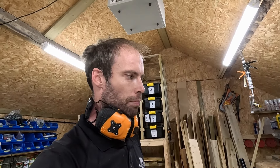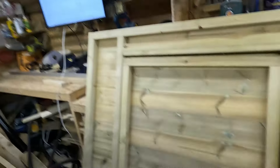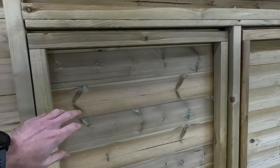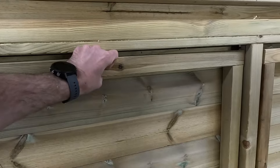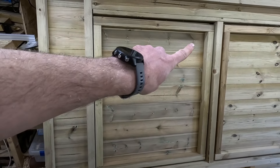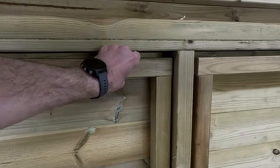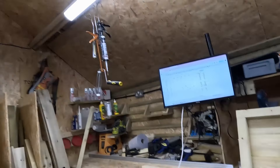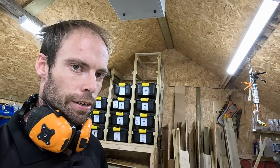Well, it doesn't always go as planned. This is the current issue. So this is the back of the front piece - these are the doors here, you can see the gap around. I have forgotten to put the diagonal in. Normally I have a diagonal piece that goes from that corner up to that corner there, and it just stops this end from sinking over time and sagging. I completely forgot to put it in, so I'm going to have to try and squeeze it in somehow.